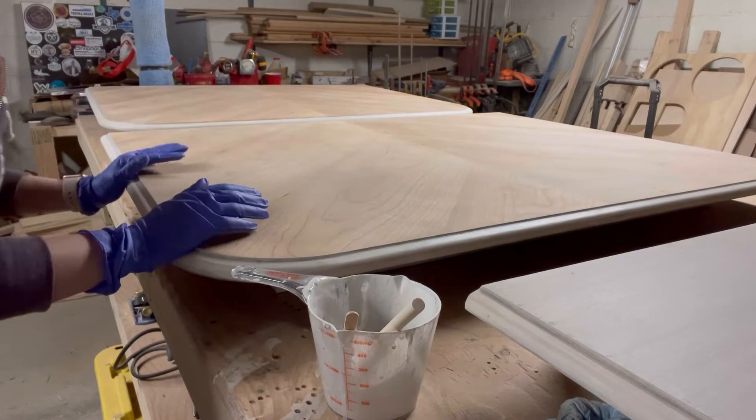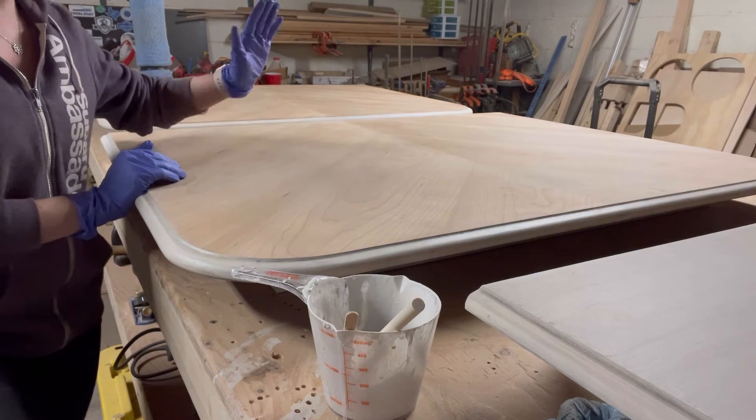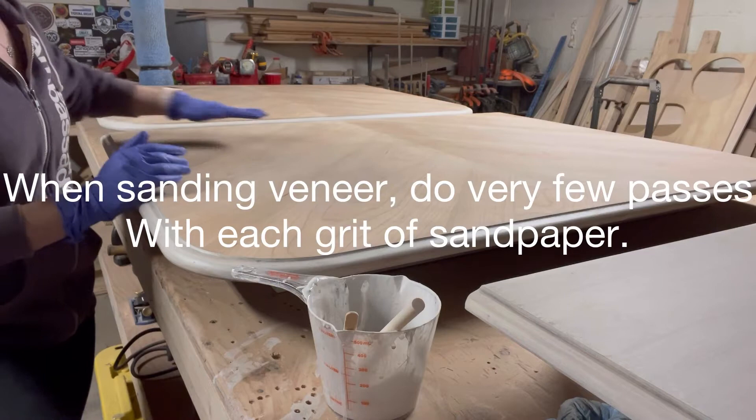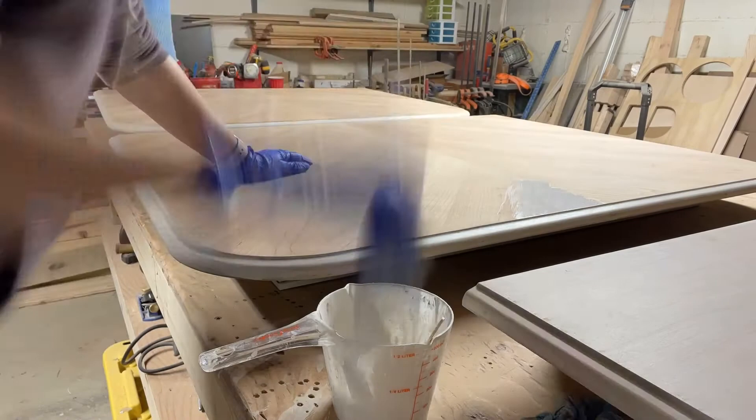I have now sanded all this down and it's ready for the whitewash. I first sanded with 150 to make sure I got everything off from stripping, then sanded with 220 to make it a little smoother, then brought it up to 320 to make it very smooth. Now we have the feeling that we want and it's ready for the whitewash. Let's get to it.